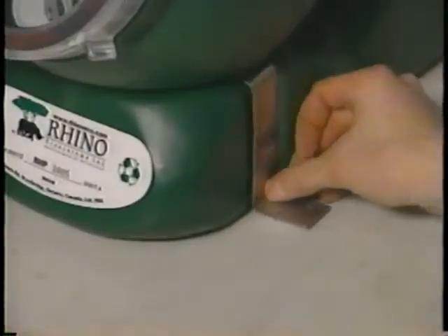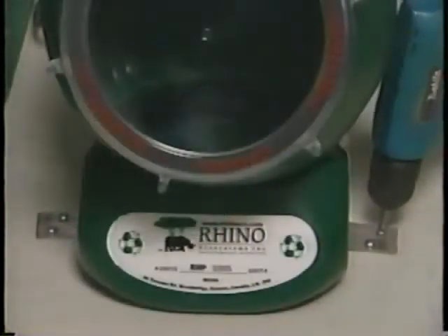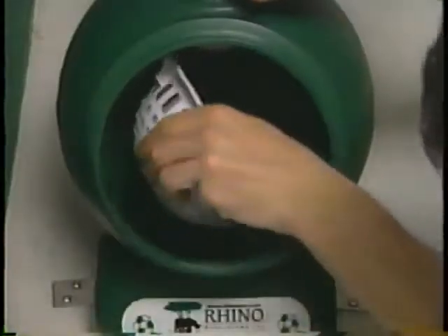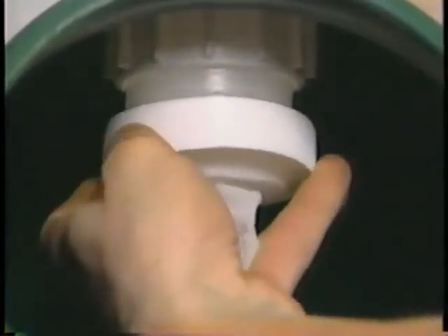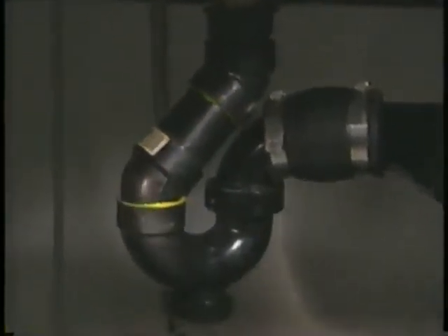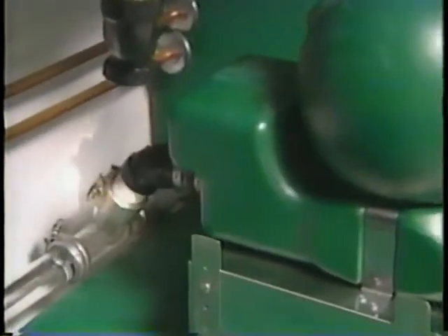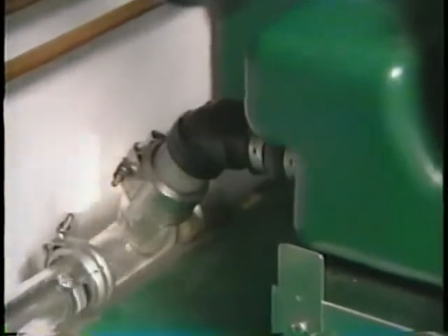Once you've got these connections completed, firmly secure the Rhino to its base with the two ground brackets in your kit. Now insert the strainer and a filtration membrane. Push up and rotate clockwise. Run water through the unit, checking along the way for leakage from the outlet downstream of the P-trap into the Rhino top inlet port, the connection exiting the Rhino at the back, and the connection into the drain connector that leads to the grease trap or the sewer. Congratulations — you've installed your first Rhino gravity unit.